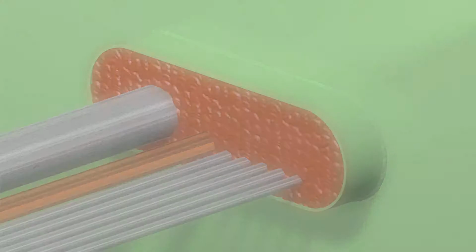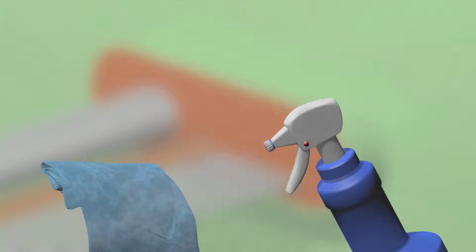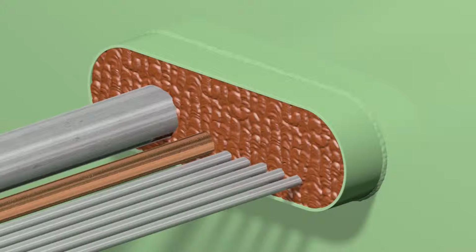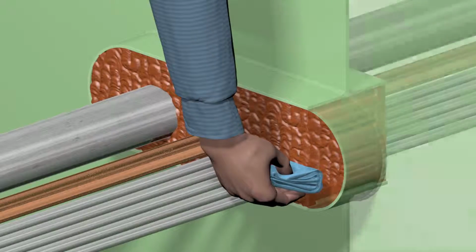To smooth the surface of the NOFIRNO sealant, a cloth is sprayed with water. This prevents the sealant from sticking to the cloth. Do not use soap water. Soap water will have a negative impact on the adhesive properties of the sealant. The cloth is then used to press down the sealant layer flush with the end of the transit frame.